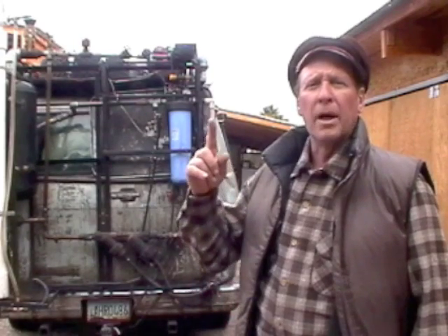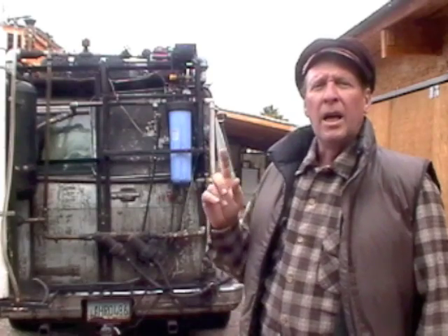From those Y-traps, it goes up to my 20-inch bag filter, which has a 1-micron bag filter in it. Then from there it goes right to my fuel tank through a fuel valve. I'll give you a close-up of those features next.